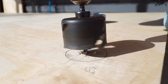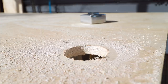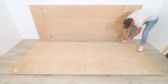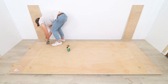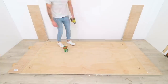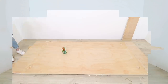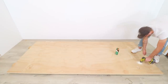Because the tabletop is two layers of plywood thick, the base will go through the bottom layer but be stopped by the top layer, locking the base into the tabletop without requiring any fasteners — and making it easy to transport and assemble. I applied a considerable amount of Gorilla Wood Glue to the plywood, especially around the edges and seams, then used inch-and-a-quarter construction screws to attach all the pieces together. Keep in mind we'll be routing out sections for power outlets, so don't put screws anywhere you're going to run blades.